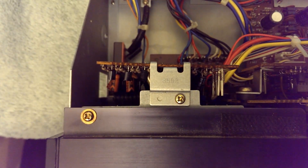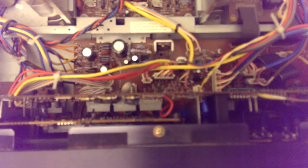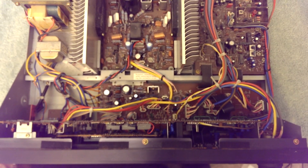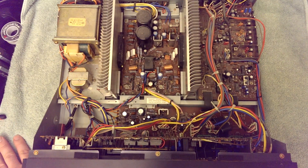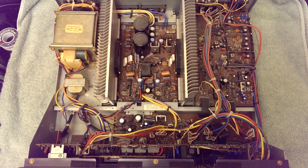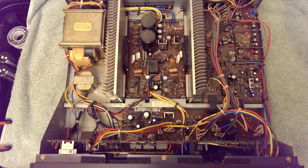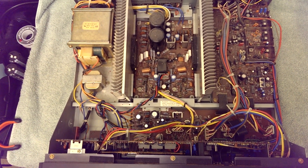There's the EQ board. I'll inspect its caps and run signal through it to make sure it looks good on the scope. If I find any discrepancies I'll change parts. Not changing all the parts does lower the cost of these units, and I can't charge a bunch of money for a Fisher anyway — the market doesn't allow that. I generally don't do a whole lot of work to them, but I do make them good enough to sell and good enough to last well beyond the warranty period I give them.